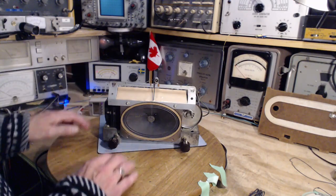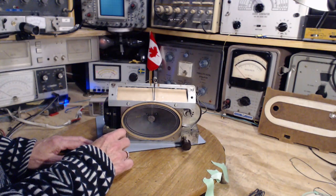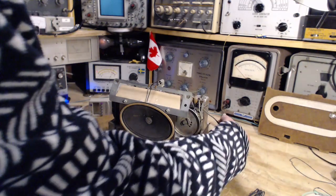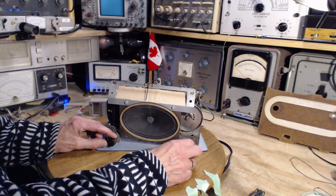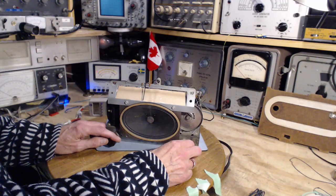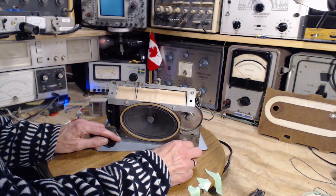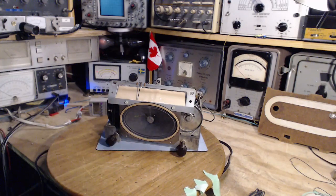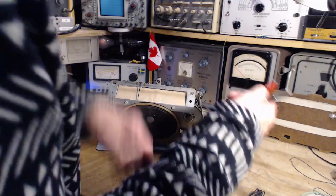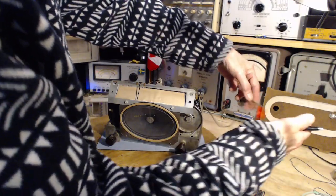That's probably enough. When you drop the supply voltage, it takes quite a bit longer for the tubes to warm up. I can hear a little hum. With no antenna — just a piece of wire — there are some powerful noise signals. We need a bit more antenna, so let's put the lead on. I may have to run down and turn the actual outdoor antenna on.